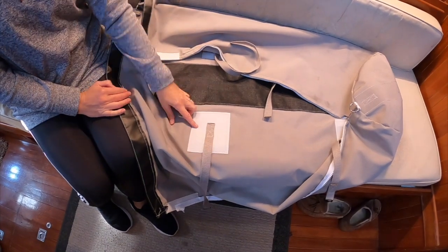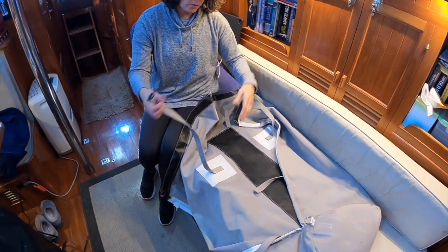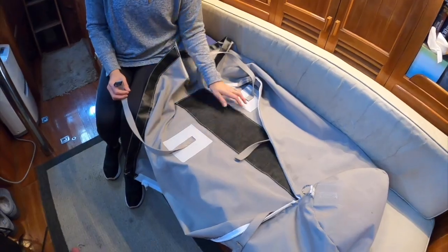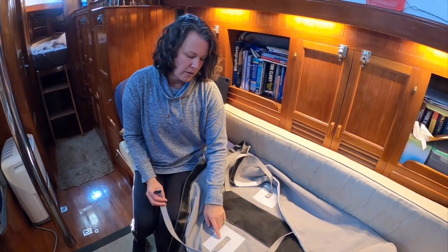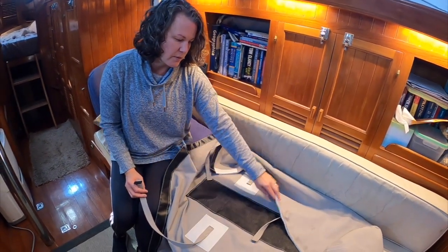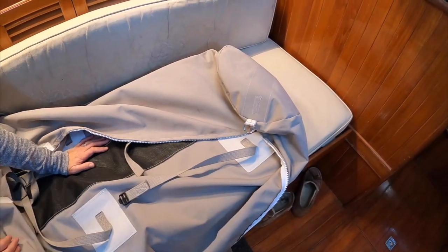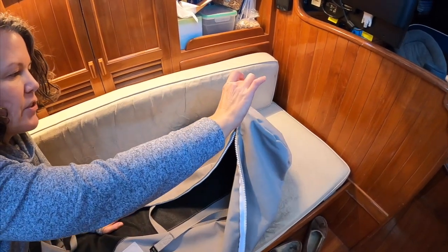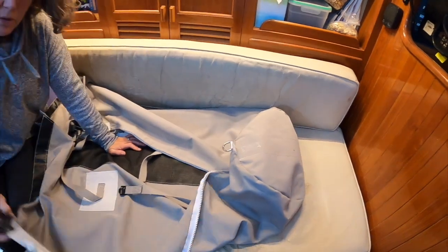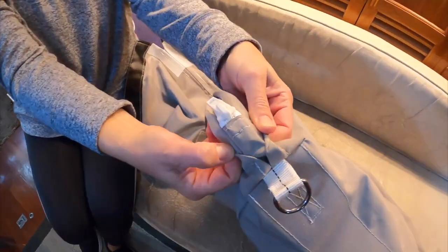We wanted some sail ties that were kind of built in so we could just grab the sail and get it under control. I put these Dacron patches in — the canvas book says you want two inches on each side for a patch. So this is two inches, this is five, and this is six, giving me two inches all the way around on each one. We have two in the front and two in the back. We also did a D-ring on some webbing to attach the back so it can be up off the deck. For the zipper, we did kind of a parka-style zipper, and I made the stop at the back because I had to cut it.